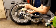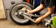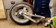Even with the caliper bracket now up against the arm there, the wheel is, I think, a couple of mil off. You can't get it in the middle. Well, it's okay. We can shim the swing arm, so it's not a problem. We can actually adjust the swing arm, which means your shocky mounts won't be absolutely level. Don't care. If it's 2 or 3 mil.